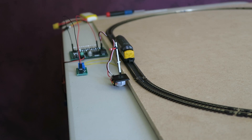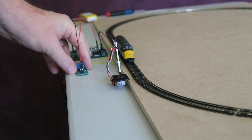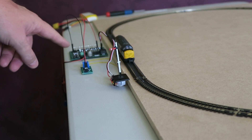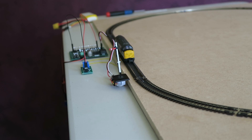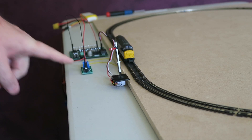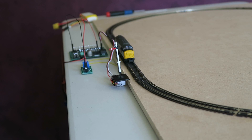I just thought that was a neat little trick to show you — with a standard servo controller and a servo-controlled semaphore signal using one of the inexpensive block detectors. And to get it to move in the right direction, I pressed and held the mode button, which simply reversed all of the inputs, which makes them fit for use with this in the normal direction. Now what I've shown you will only work with a standalone servo controller — it won't work with a multi-panel — but we've got to save something for another day. Thanks for watching.